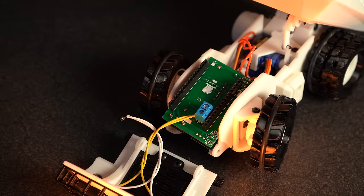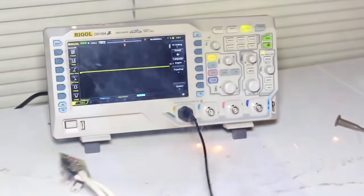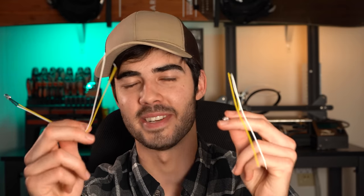Originally I was thinking I'd connect these wires via one of the aux pins on the printed circuit board. But if anybody wants to upgrade to a high-powered RC light bar, chances are it's going to pull more than 40mA — just alone, each one of these LEDs pulls 20mA. An ESP32 can only realistically sustain about 40mA off of one output pin. So using the extra terminal block coming off the H-bridge, I'm routing the lights into those, as they can realistically sustain up to 1A of power — which would be some really bright RC headlights. You could probably wire up about 10 of these and be just fine.